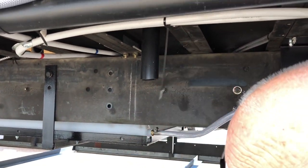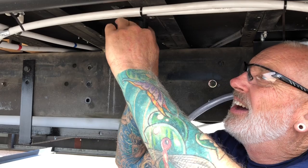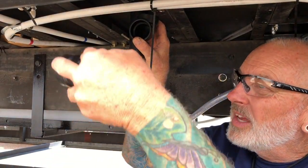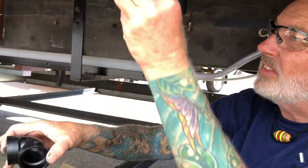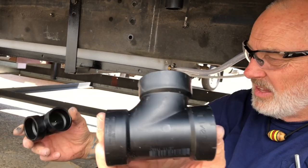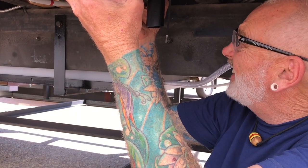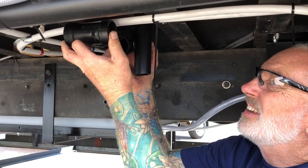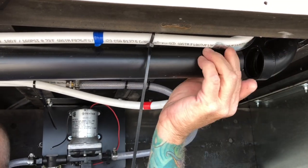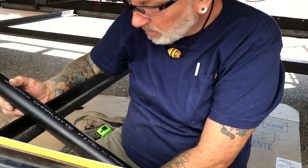You can see our pipe coming down. I'm so thankful that we got room down here to work. Now all I've got to do is bring this over to that, and I can bring that one into there — it sweeps around the corner and goes that way. We want to have a drop on these so the water drains. It'll run downhill to that one right underneath these pipes, and I got that glued up on the top already — that's the vanity, the bathroom sink.